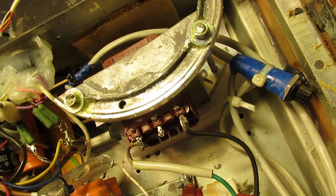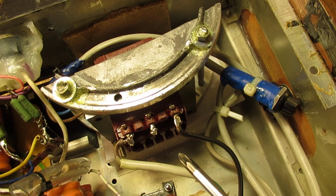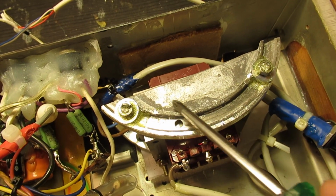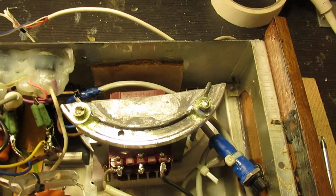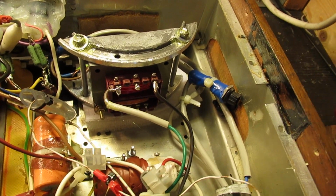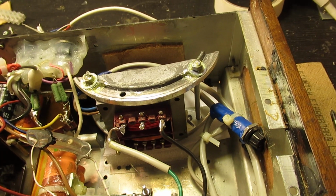Well, here it is again. The transformer. I took out the old transformer that had too high a voltage, and this is a 24 volt transformer. It can give approximately 1.5 ampere or 2 ampere, and you can see these big aluminum strips bolted to the core of the transformer to dissipate the heat inside. That's of course kind of not normal anyway. This transformer was, in my opinion, perhaps made for another purpose, not for a real audio application.